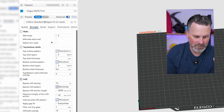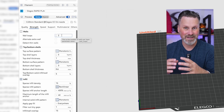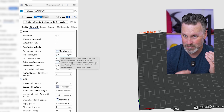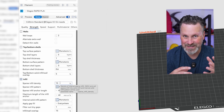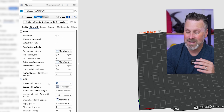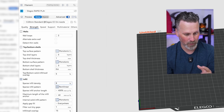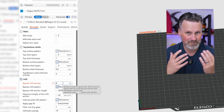So from there, we're really going to start looking at things like the number of walls. I'm typically not reducing beyond 2 - I'm typically increasing to try and increase the overall rigidity and strength of the object, but a lot of times I just stick with the default 2 wall loops. You can also play around with top layers or bottom layers, but I just stick with the standard 5 or 3 that most slicers default to. The obvious one is if we want to increase or decrease overall print time, we're going to be playing around with the infill. The default in this slicer is 15%; I almost always drop this down to 8% or 10%, depending on what you're 3D printing.